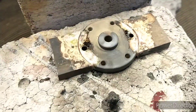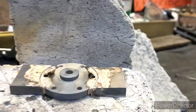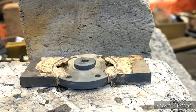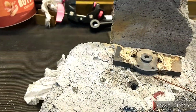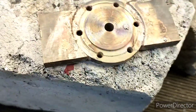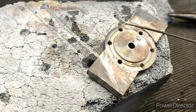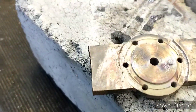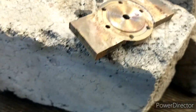The silver soldering is done. That went reasonably well and it looks like we've got decent penetration into the join, as far as I can see. Let's flip it over and have a look. It looks like we might need a bit of machining — or actually that might just be flux, so we might be lucky. Overall it looks like that's worked okay.